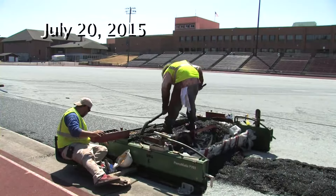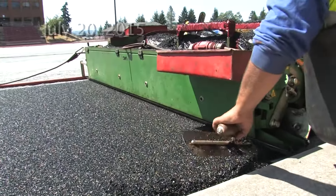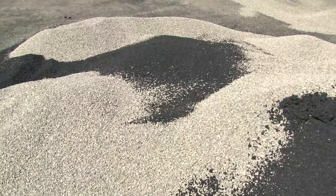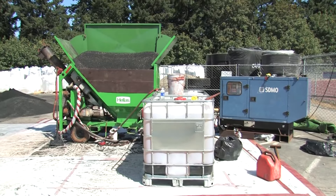What they're doing right now is they're adding — putting it down, or almost like paving — the E-layer. The E-layer, or pad as they call it, is a mixture of pea gravel, rubber, and polyurethane that's all bound together.